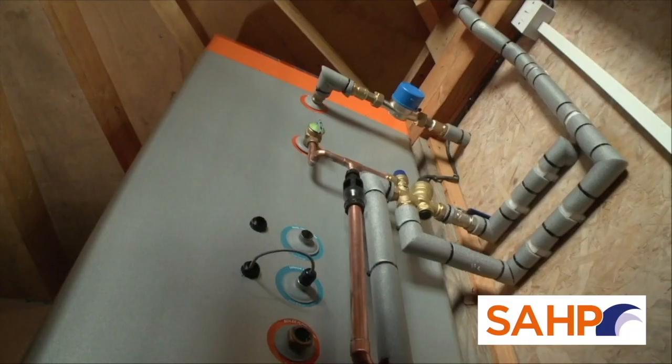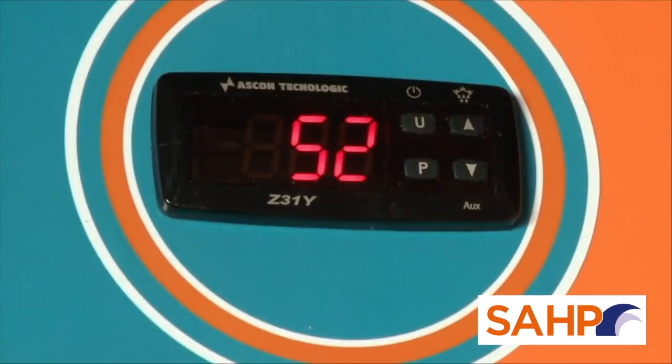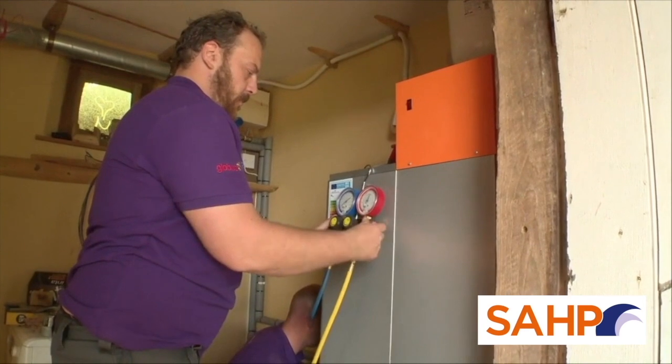Our thermodynamic solar system heat pump can best be described as a fridge in reverse. Many people understand that the panel at the back of the fridge is a factor in keeping its contents cold. Reversing this principle by using an aluminium evaporator to absorb heat, as opposed to rejecting it as a fridge would, allows us to utilise ambient air temperature, day and night, in all weather conditions, to capture energy and transfer it to potable water, heating it in the process.